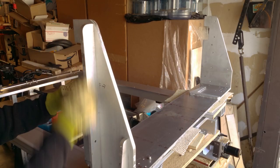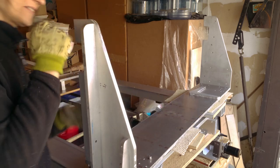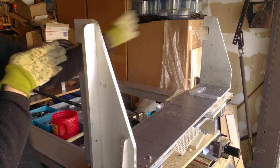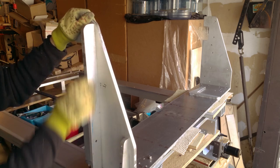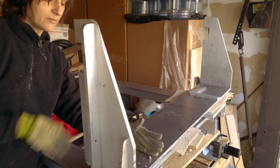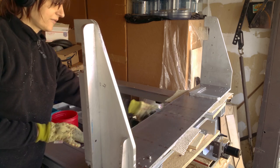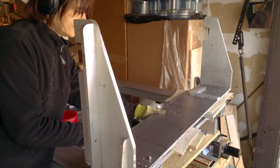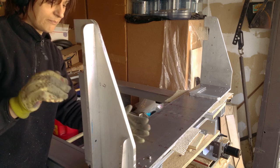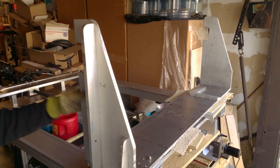I got one side done as far as these supports in and I can't move it, so I'm happy with that. This whole thing vibrates on both sides. The axis is going to be bolted here and it's going to connect these two rails, so the lateral strength will be multiplied by two and you just have to worry a little bit about twist - most of the twist will happen between here and here. This basically is just going to operate in kind of a planar way, pulling kind of on the edge of this in almost kind of a shear way. Most of the twist will happen between the rails and this.